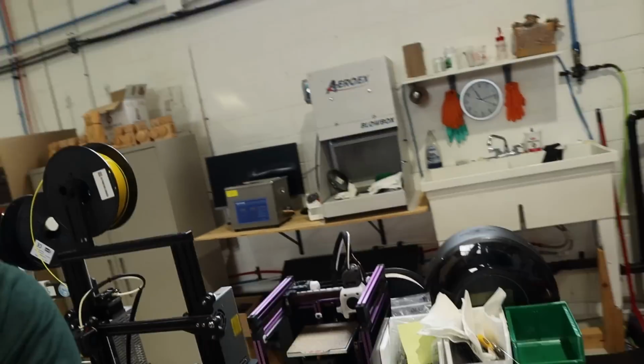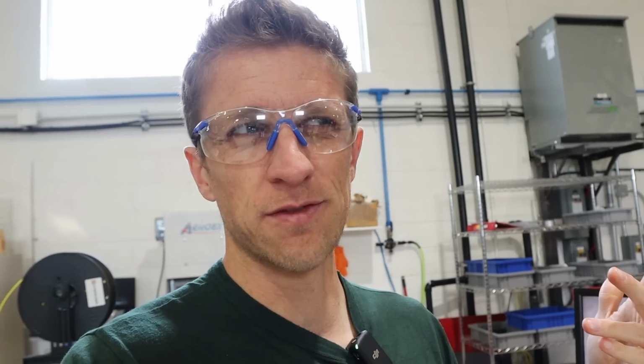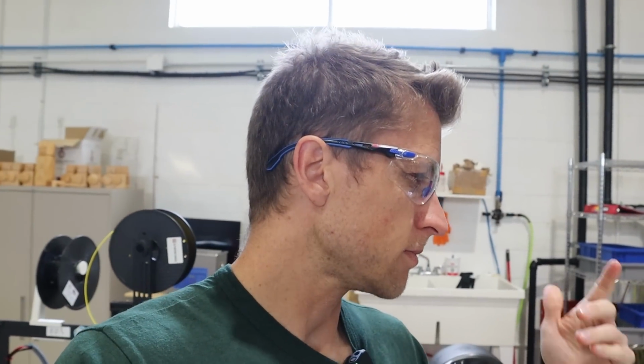Well, still chipping. One part. Okay, so when you try to isolate every variable, and you try to change material, you try to change depth of cut, I haven't changed speeds and feeds, maybe I should look at that. Usually when I get to this point, I wonder, am I the problem? Is my brain telling me to do something that I shouldn't be doing? Is the way I've designed the tool path, the depth of cut, the speeds and feeds, things like that, am I making assumptions that I don't know about yet that are causing this to happen, which is driving me crazy, but is a challenge.